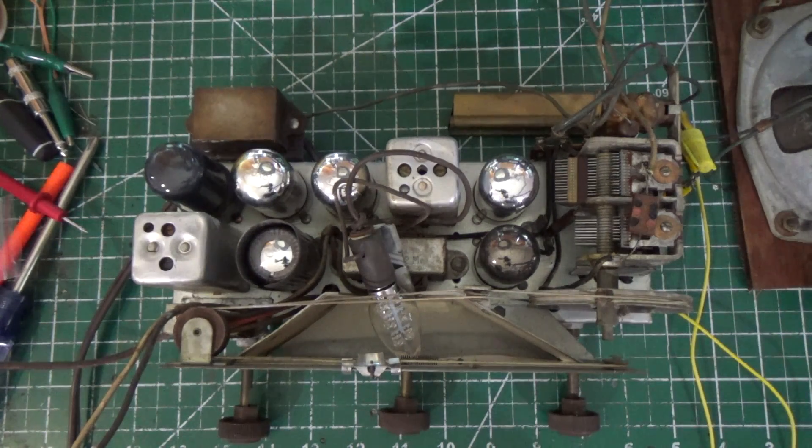What we're going to work on next — we have our audio generator slash dummy load box, and I'm still building that circuit. And then we're going to be working on that console radio, which was the Philco 41-280. I've actually taken it out and looked at it and it's going to require quite a bit of work. But I've decided — I had some comments from Phil over in England that I should turn it into a Bluetooth set — and I'm going to do that without destroying the circuit. So I am going to build Bluetooth capability into it. It's got a really large speaker in it — I bet it's going to sound awesome. It's got a push-pull type amp in there, I bet it's going to sound really good.